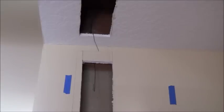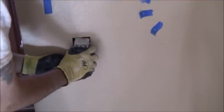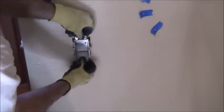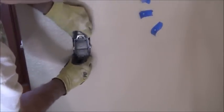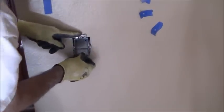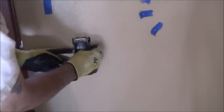I've already got the cut-in box done — let me show you that. There's the cut-in box. I already did a dry test fit. When I cut my hole I want it to be at an absolute bare minimum so that it just grabs as much drywall as possible. On this box the way they have it with these wings, I had to do it just like that — it should work out fine.